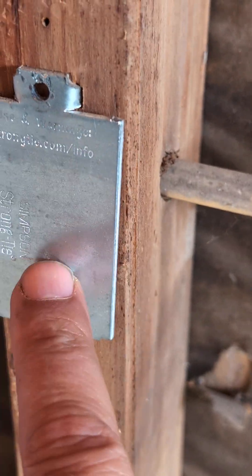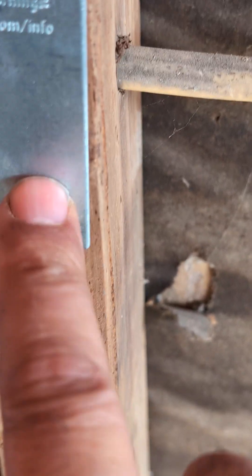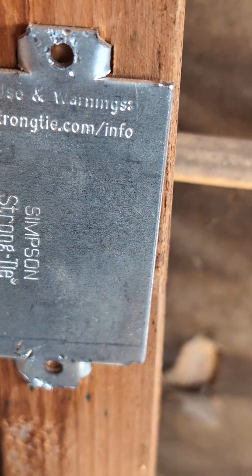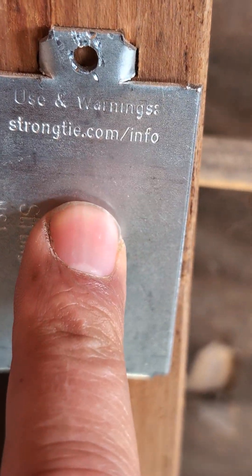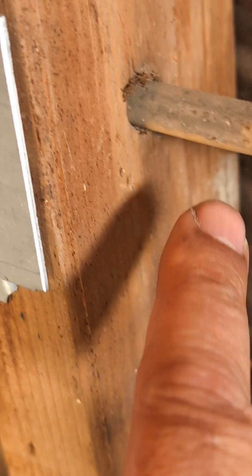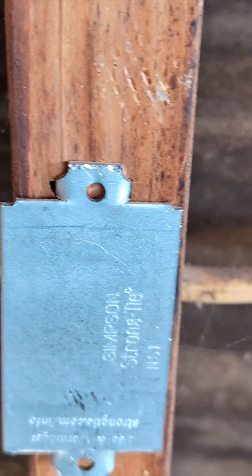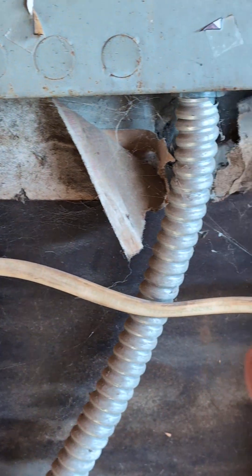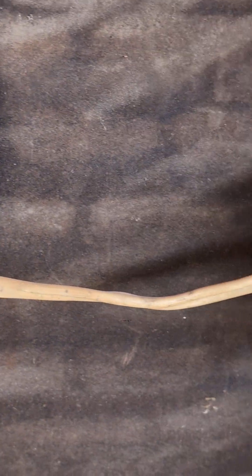Every 2x4, we have a plate that will secure the wiring — if you're nailing on the wall and the nail hits this area, it will actually protect the electrical wiring in case you're using a very long screw. So you do that in every section where the wiring runs through. This will prevent any future accidents.